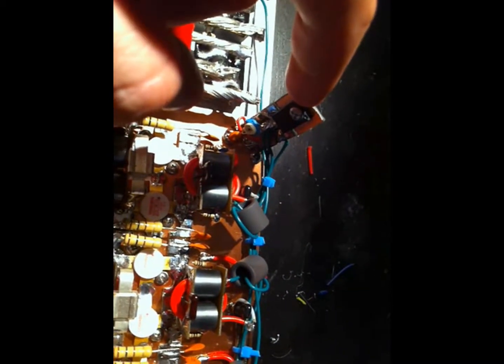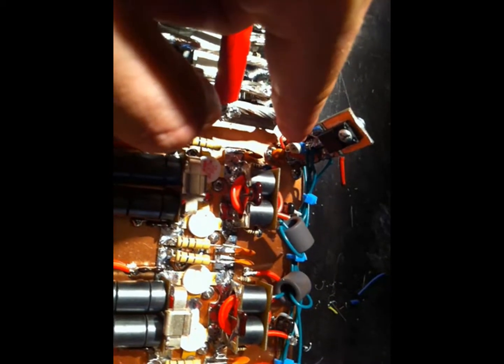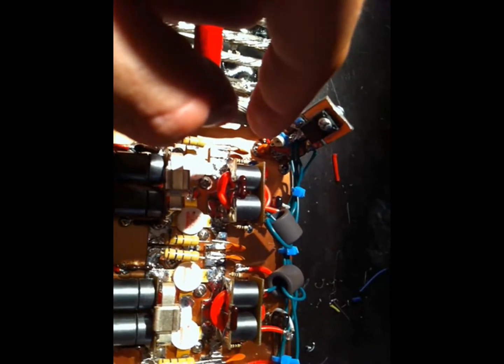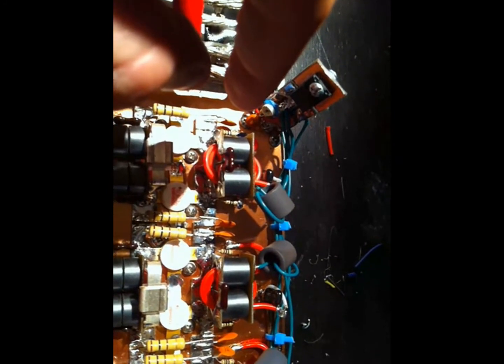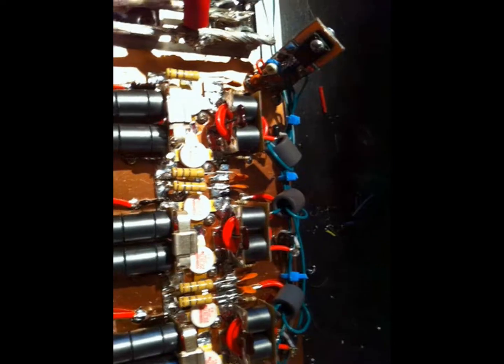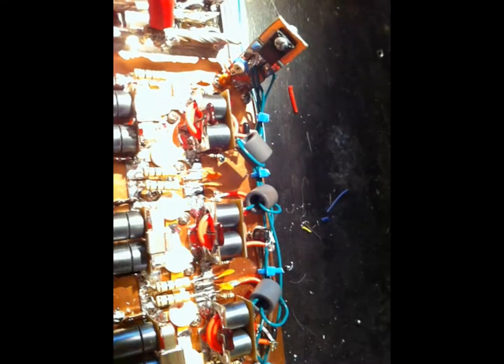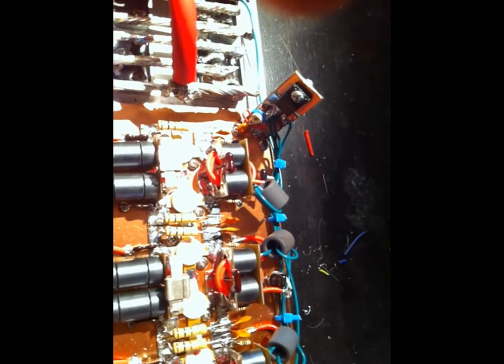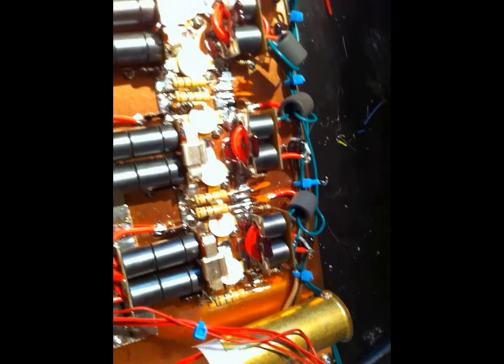Here is the bread and butter — this right here is our biasing circuit. It actually controls all three two-pill sections. With the little pot, we can take this on the scope and tune it from anywhere between A-class, AB, and B-class. C-class we can do as well. Say if you're a big sidebander and you want crystal clear on sideband, but when you go on AM you want that class C power — we can actually make a multi-biasing switch where you can switch from A, AB, B, and all the way down to C. Give us a call or drop us an email and we can definitely make it happen.